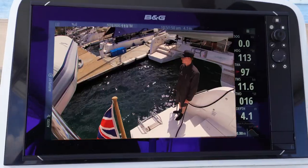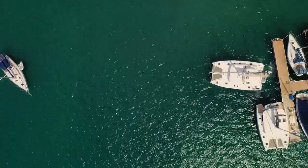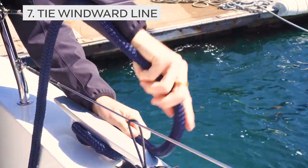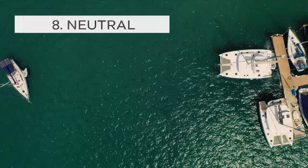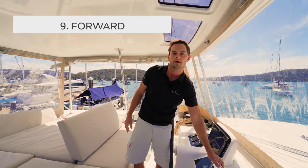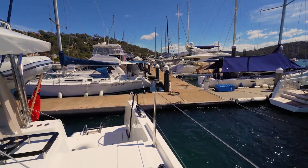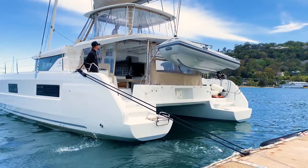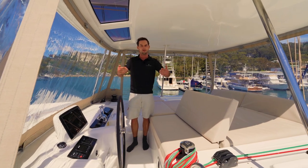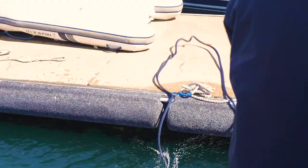I can see on the camera I've got five metres to the back. I'll let a bit more chain out to come in. I can see Ben on the back now — he's got the port line on. I've stopped the boat in neutral and I'm waiting until Ben has secured the port stern line. Now I can drive on that with both engines, which will help the boat stay to windward and prevent it being blown further down the dock. With one line on and the anchor out the front, we're at a fixed point on the dock, and I can now instruct Ben to get the starboard line on.